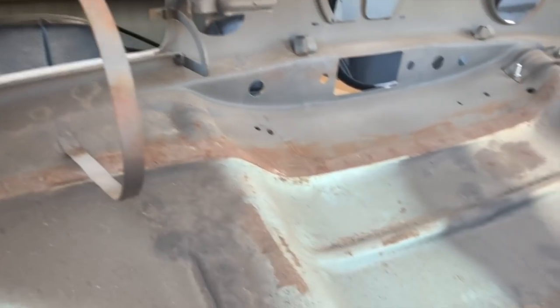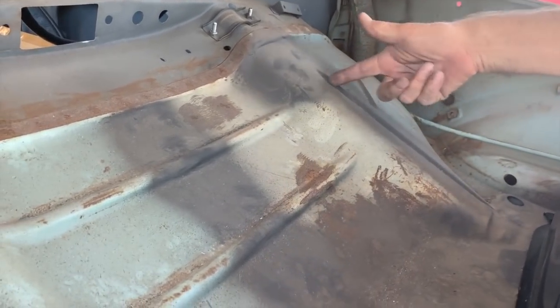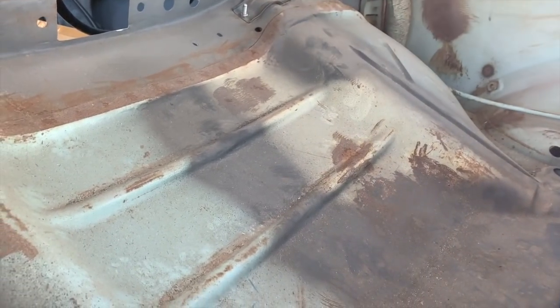And then this had to get wider here to fit the lower opening for the oval dash, because that whole shape there is completely different. And it's amazing how close it does line up. Once you split that, because you split right here, because normally there's 2 creases here. And you just cut that crease and the next one and bring it over so the weld is right down the middle of that crease, so it makes it really easy.